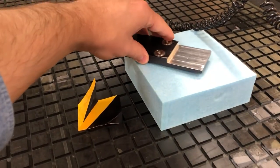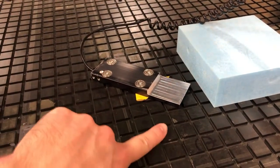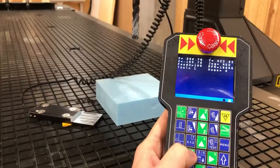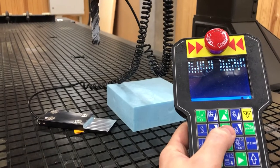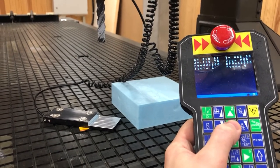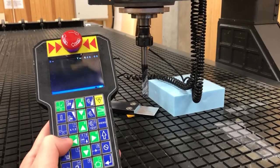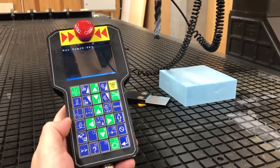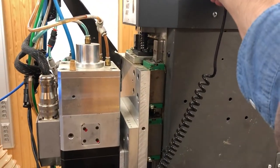Place the calibration plate on the machine bed, but make sure to use something to increase the margin between the actual machine bed surface and the bottom of the calibration plate. Jog so that you are above the calibration plate, then jog down in Z so that you are approximately three fingers above it. Set the maximum depth — hold zero to auto-set. Gently reattach the calibration magnets and the calibration plate to the top of the machine.